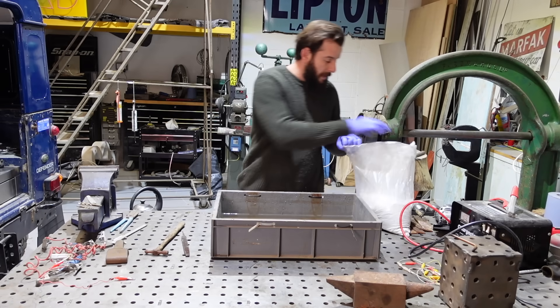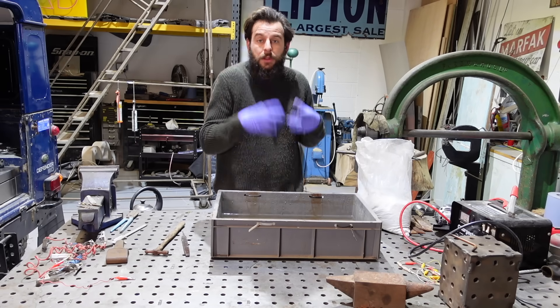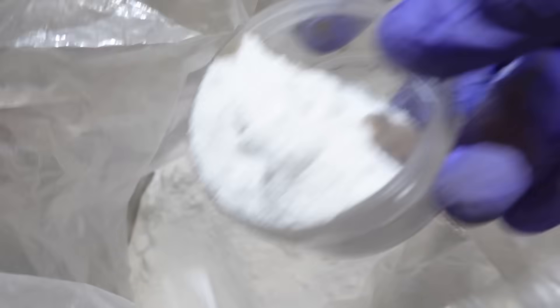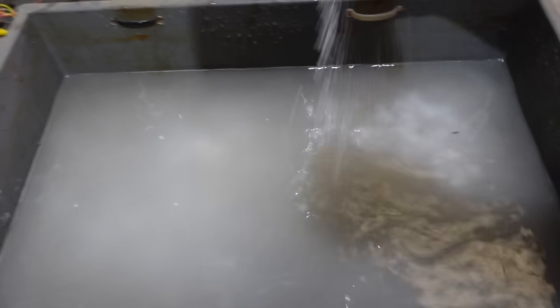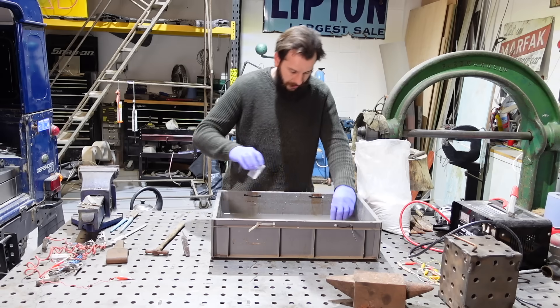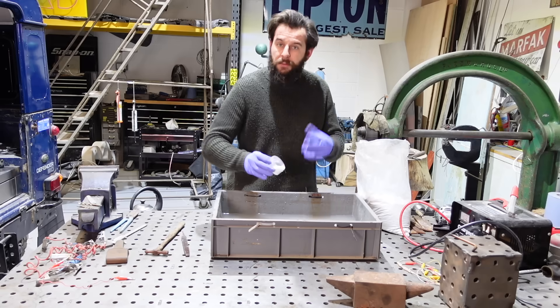You can use various different things for this — cleaning soda, soda crystals. Not baking soda; from my experience, baking soda is a very different product. Soda crystals or cleaning soda is what you want, which is basically sodium carbonate. It's really cheap. Make sure you wear gloves with this because it can be an irritant to your skin. I find the more of it you put in, the more conductive the water gets, so the easier it is for the electrical current to pass through. It stops dissolving when there's enough — I just go by eye. Give it a good stir and let that dissolve.